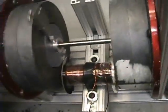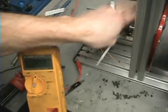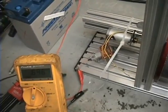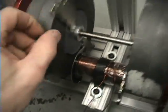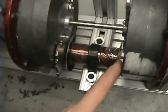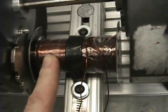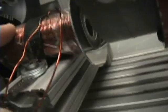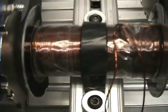It's a 12-volt motor — at least that's what I'm putting into it. This is set to AC. If I spin this by hand, you can see I'm getting about five to six volts, just spinning it by hand, to show you that it does work. These plates are opposite each other so when one hits the coil and shields it, the other side gets magnetic flux, and then they alternate. These are north-facing in. This coil is 18-gauge wire — it could be 20-gauge — about 200 feet on a steel core. I did hand-wrap this bobbin, and it turned out pretty well.